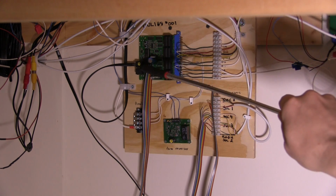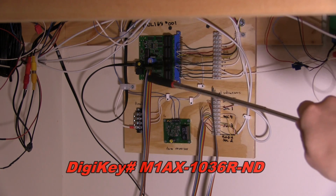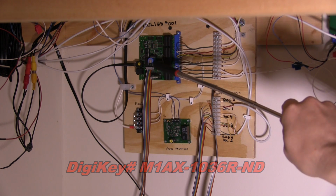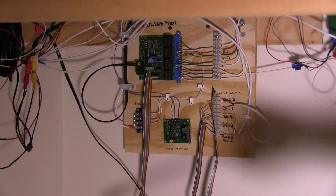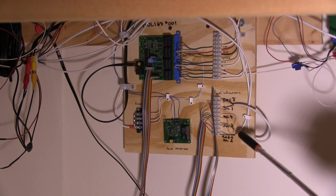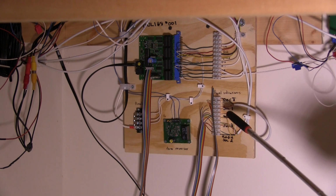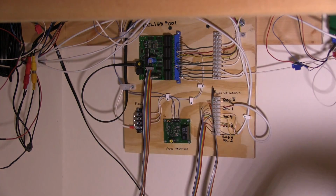Now these ribbon cables, this is actually a product I got from DigiKey. It's made by 3M. Digitrax recommends it because it's got this nice little connector. They're all pre-made up, and you just put it right onto their jumper board. And then I brought all the cables down and tied them in. And all this white cable is phone line cable. I used it because it had multiple colors inside, and I used the phone line cable to send the signals to the LEDs at the control board.